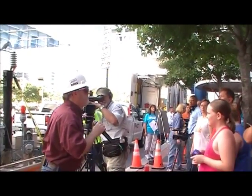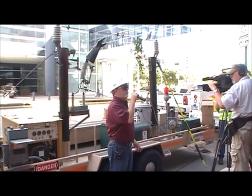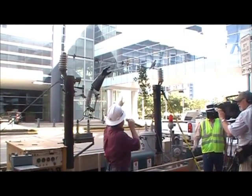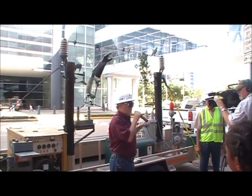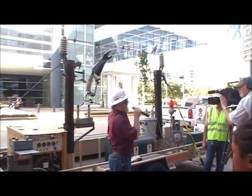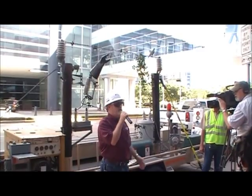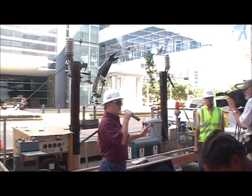What kind of distance do you need from a wire to ensure you're safe? The distance for workers is 10 feet under OSHA law. On this conductor, Greg got within about three-eighths of an inch before the arc sparked over. On our higher voltage transmission lines, which run up to 345,000 volts, it might arc over about a foot. But even though you have to get three-eighths of an inch away before it will arc over — do you want to get that close? No. You want to stay away from the power lines. The insulation is the air gap between you and the wire. Keep your ladders away, scaffolding if you're doing roofing or painting, any kind of pool skimming tools — all these items you need to stay away from the wires.